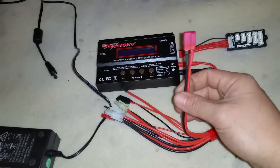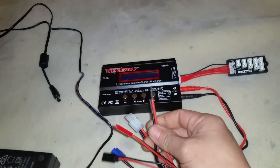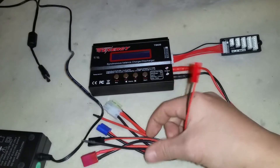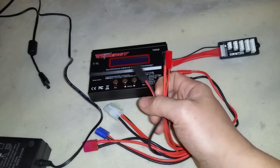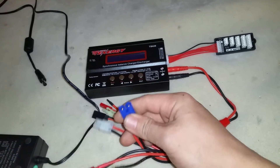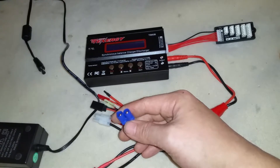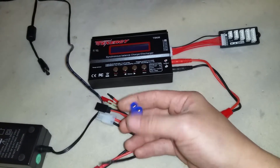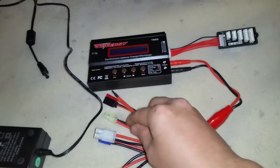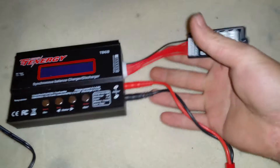The octopus actually has only seven leads if you count them, though it comes with eight actual wires with one extra you can solder on your own connector. You get a Dean's, an EC3 — which can also fit Venom packs with multiple sockets — and the tips are changeable. It also fits the XT60, Tamiya, mini Tamiya, Futaba, and JST. It also comes with a balance board that just plugs in.